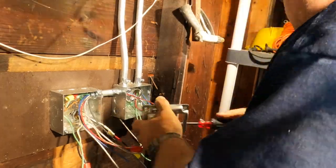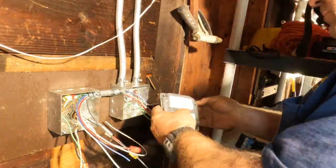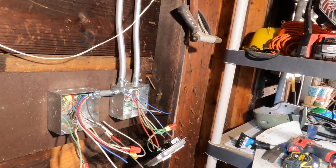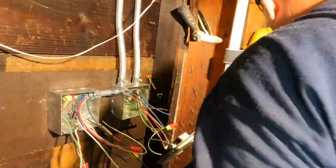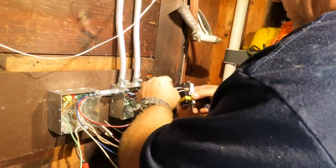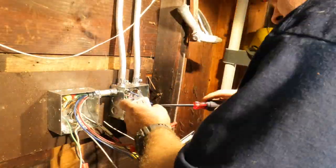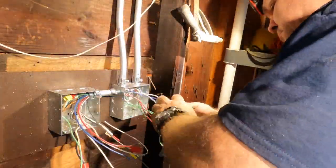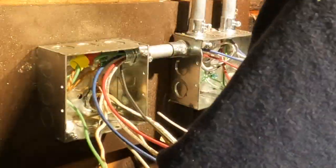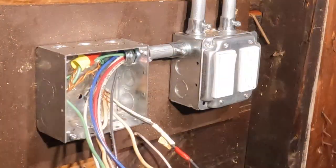Down below I'm putting in a tamper-resistant GFCI receptacle and a decor-style switch, using four-inch square covers. Normally I wouldn't put a fancy decor switch in a garage, but it made sense here. I probably should have done a decor switch on the left box too, because that's my main shutoff for the garage power — which is required by code. Any time you run wiring to a new structure like a detached garage or shed, you must have a disconnect; that is a code requirement.